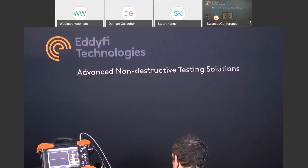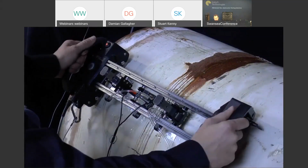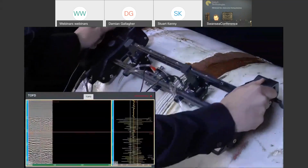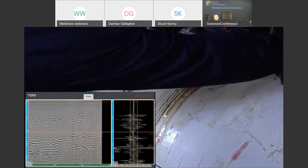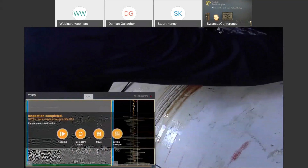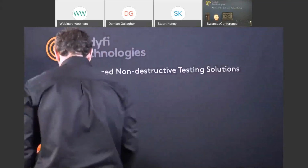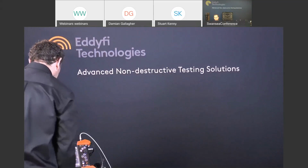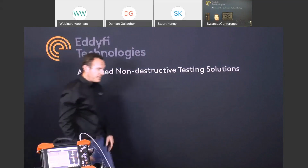So we've got signals. On the scanner we've got brakes on the front end, so we can disengage the brakes. Got nice handles, and we just move forward. You can see the data capture. And we'll get to the end of the scan. Nice. We can reapply the brakes and turn the water off. You can see that the scanner holds nicely on the system. The system is actually being tested to hold its own weight with a fully loaded 6-probe assembly, and when the brakes are engaged, they'll hold the system in place. It's a perfect scanning solution for rope access.